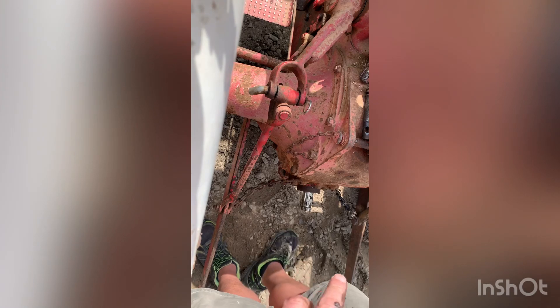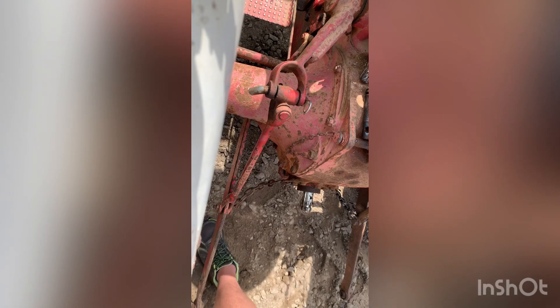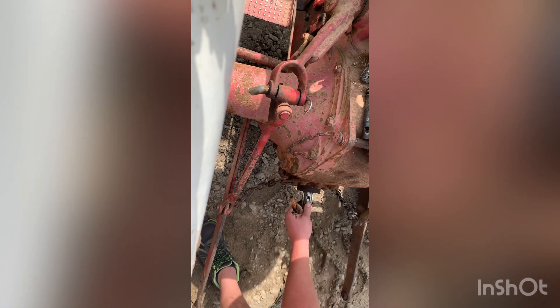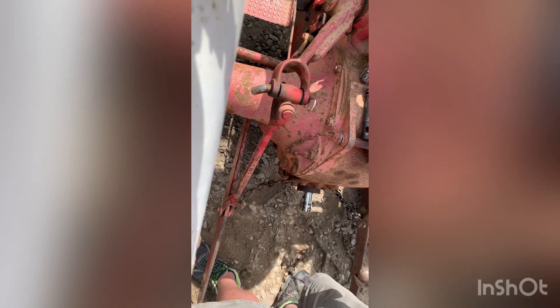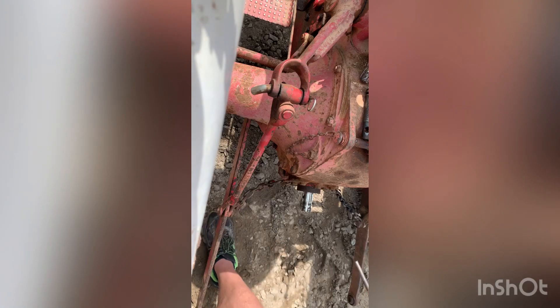This works the exact same way - the roll pin is just the length of the outside diameter of the coupling. What you've got to do is knock it down flush, ever so slightly, and check on both sides to see where you're at. You can see I'm still a little bit high on this side. That looks pretty flush right there - give it a spin, just a little bit more. This doesn't take too much force. It pretty much just keeps this coupling from falling off, which they will do. Those roll pins get old and you use and abuse them running hard - they will come off, I know that for a fact.